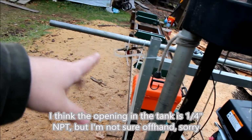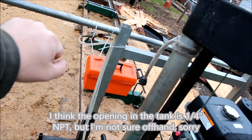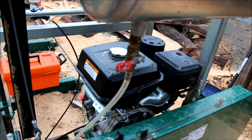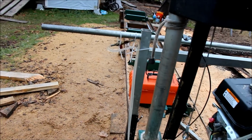It would be nice to have a grip for the lube, like you have a grip for the throttle, but anyway. So this you set the drip rate however you like, and then that you control the on-off. Start milling, turn it on, and the cut, turn it off. It's right there, it's nice and easy.